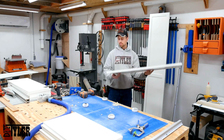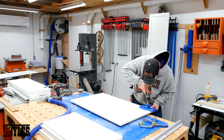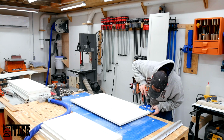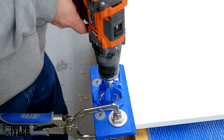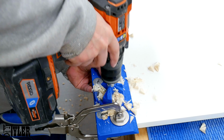Back to those magic doors. Again, if you want to see a video on how I made these doors, check out the link in the description below or in the top right hand corner of your screen. Here I am adding the recess holes for the Euro soft close hinges that we will be using, and I'm using a Euro hinge jig from Kreg Tool to accurately and repeatably drill those holes.